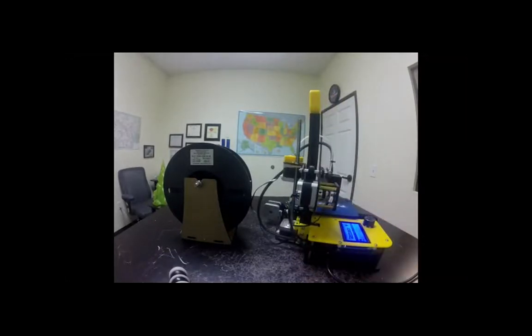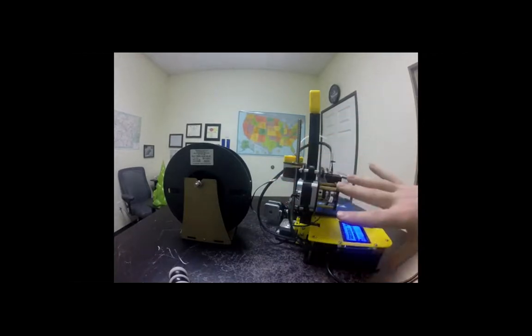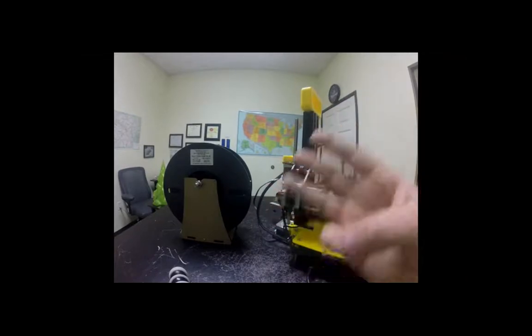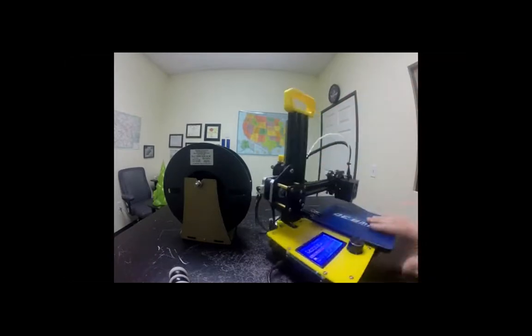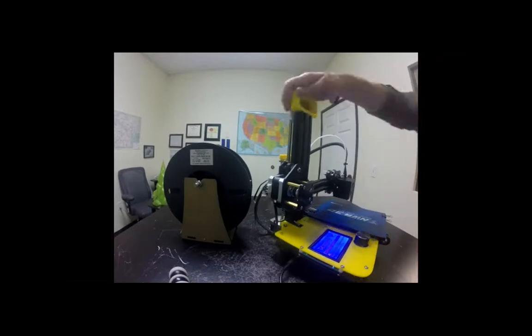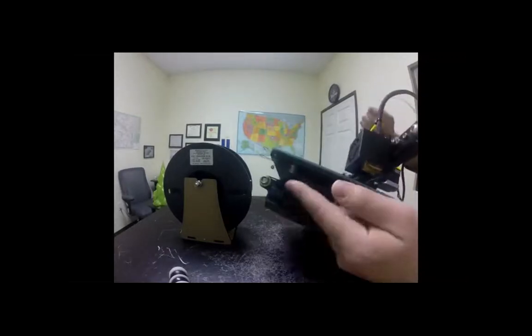To troubleshooting, we went over Cura, making sure those are right, and then we checked the printer and making sure all that's good. So we got two printers that look good, that nothing's broken on. And then the third step, that is the hardest and longest step, and that's making sure that the printer itself is level. So to level the printer, what we're gonna do is we're gonna move this nozzle around, and then we're gonna adjust these little screws on the bottom of the printer right here.